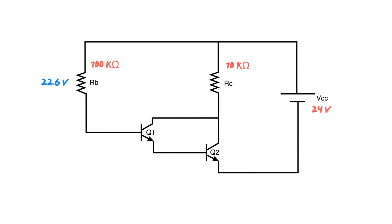Now the reason why we like to use Darlington pair transistors is that typically a transistor will have a gain of anywhere between 10 to 500. If you need to go beyond 500, that's when we start using these — we take the gain of Q1 and multiply it by the gain of Q2 to get an overall gain. So if both transistors had a gain of 10, you'd have 100 as your total gain. But let's go back to this using Ohm's law.